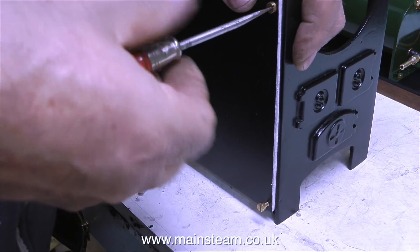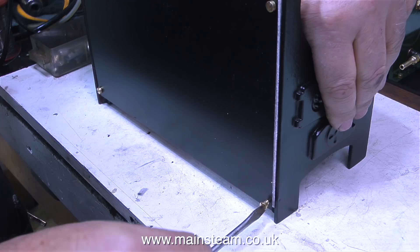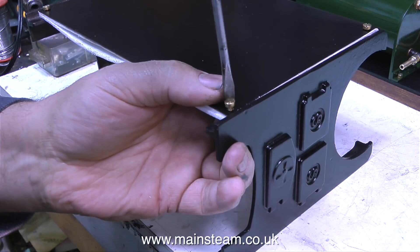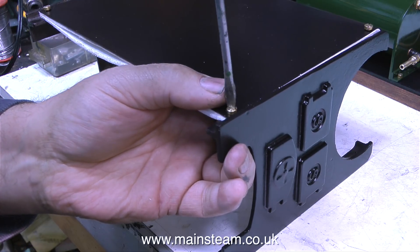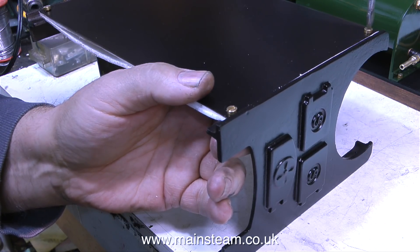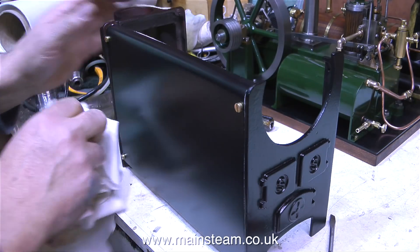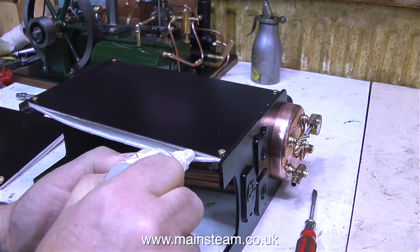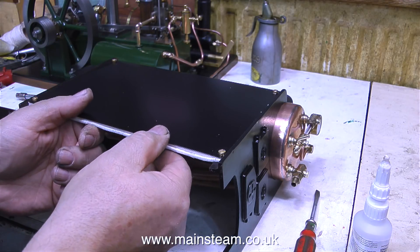What I'm going to show is how, if you do it this way, you cannot tighten the bolts sufficiently to hold the side panels in place properly. What will happen is you will get localised crushing of the insulation, as well as distortion of the side panels around the area where the bolts apply the pressure. The original shaped asbestos inner side panels were quite solid — asbestos is a much firmer material — but this material is much softer. You can clearly see how the sides have become curved where they meet the end plates, and the two layers of thermal insulation are separating.